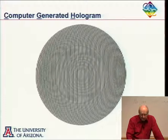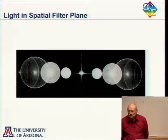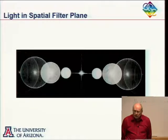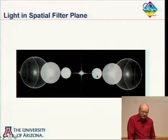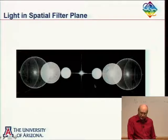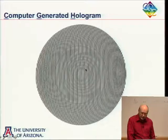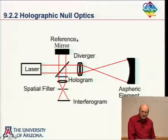Tilt carrier, the way that's shaped, kind of like a grating to separate them. Yeah. And if you were trying to do that with the original technique where you generate the hologram in the interferometer, you purposefully put in tilt and then record the hologram with tilt, does that make it the same? That's right. If you want to really separate these orders, like here, I'm separating the first and the second. I don't worry about the third and the second because I'm not going to use that. But here I've separated the first and the second order. So I had to put in enough tilt. So that's why we have a lot of fringes going across here. And physically what you would do here is you would just tilt the reference beam to separate the orders.